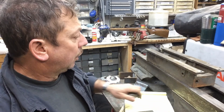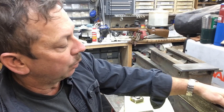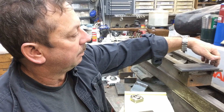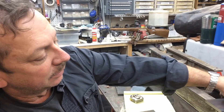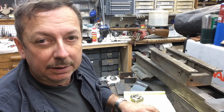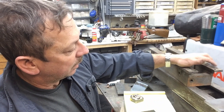I'm just building a little fixture to bolt onto my headstock bolt holes, and that's what will index everything off of. This is just going to be a cobbled-together piece. I'm going to drill and bolt this piece onto the end to index everything else off of, then tack the pieces on with the correct drill size for each hole. I'll drill two holes to locate those on the front and just tack weld those pieces in place with the TIG welder to index where they are. That way I can set this completed unit on here and have my drill points correctly indexed for the forward reverse gearbox and these two holes on the back. It's a one-time use fixture - I'll throw it in the pile of Atlas tooling but it'll probably never get used again.